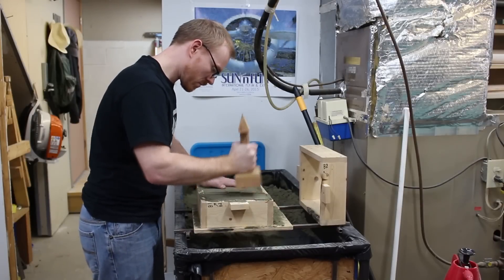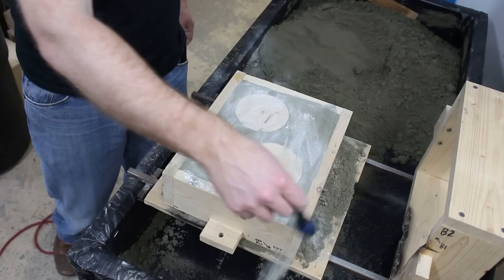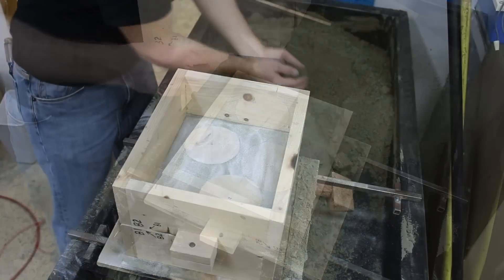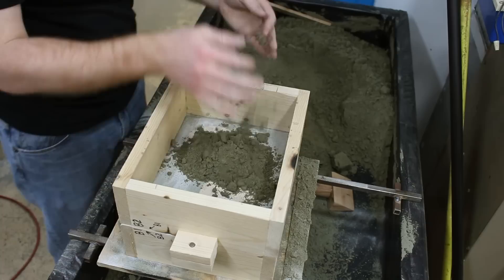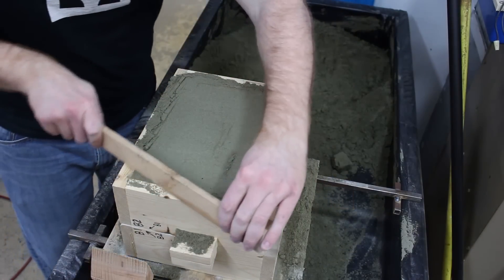After I made the pulley patterns, I molded them in the drag. However, the drag was upside down, so when I rolled it, those little tabs were at the bottom — that's not right. They should be on the top. So I remolded it and fixed it, and then I proceeded to ram up the cope, which is the top part.